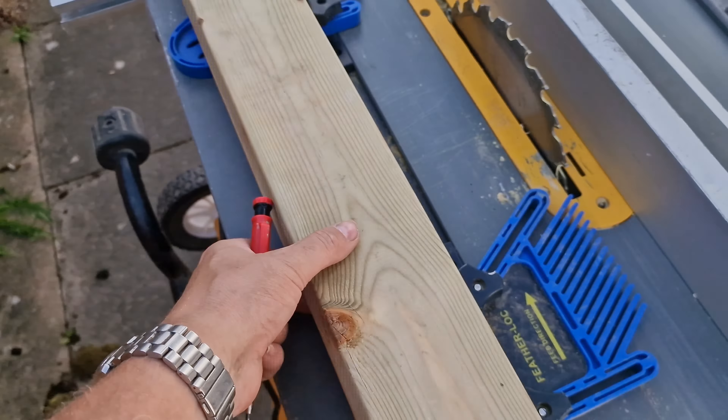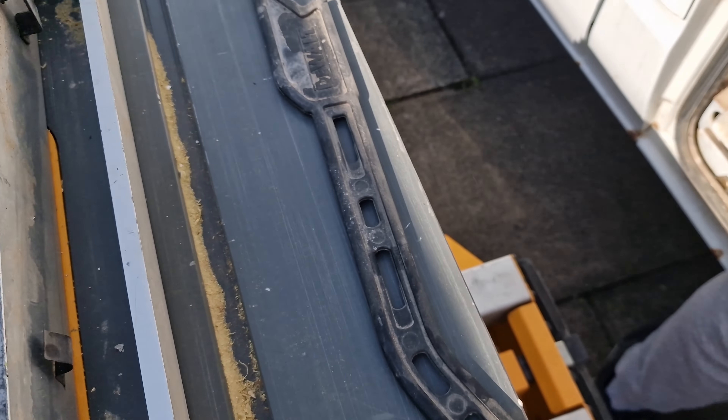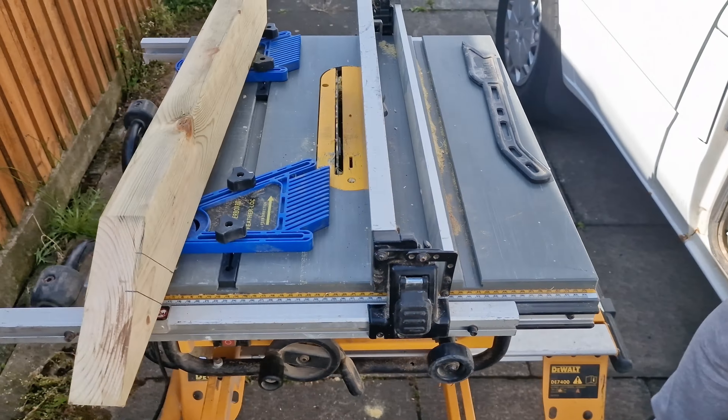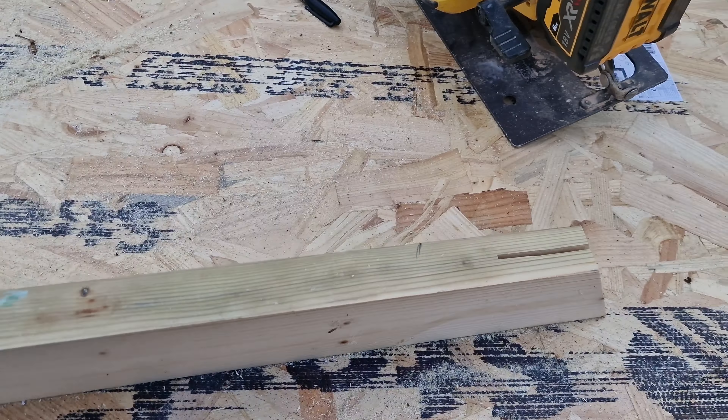The other side of the piece that's rotten, we're just going to screw it to this bit of timber nice and flush. I'm just going to cut off the excess roughly and then I'm going to use a flush cut router — like that — and then we can go around the edge of that and get a perfect copy.